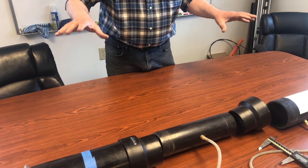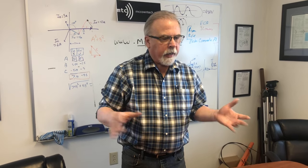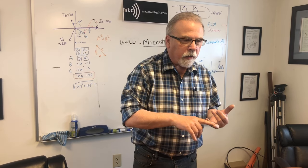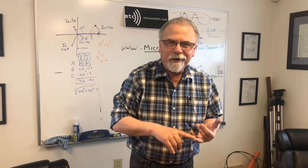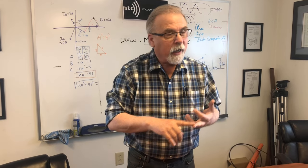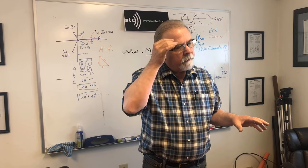So I went through several iterations trying to prove whether or not my Vac-X was any good. That summer I built pitot tubes. I threw ping-pong balls with metal tape on them down tubes with speed radar. I used hot wire anemometers. I used turbines. I did everything I could to try to nail down the velocity of the air movement in the pipe, because you can translate that directly into CFM.